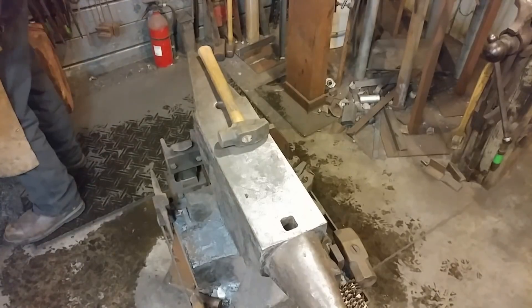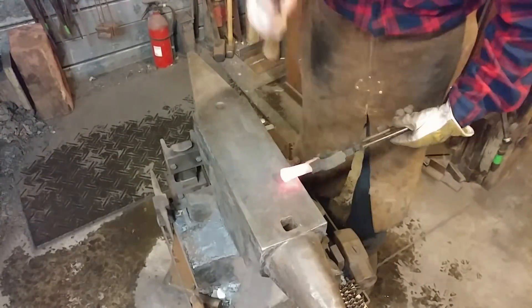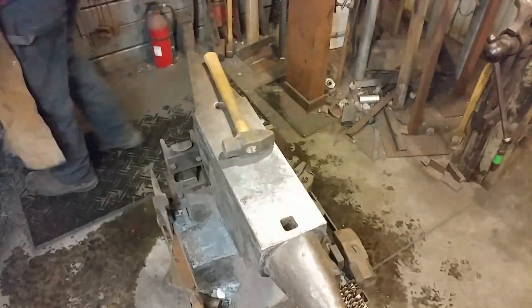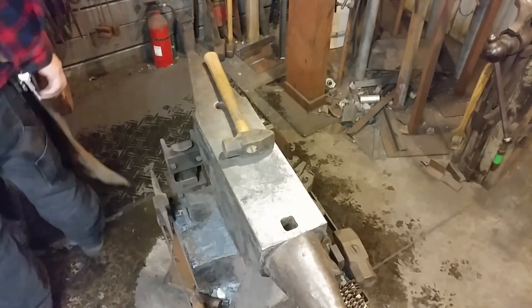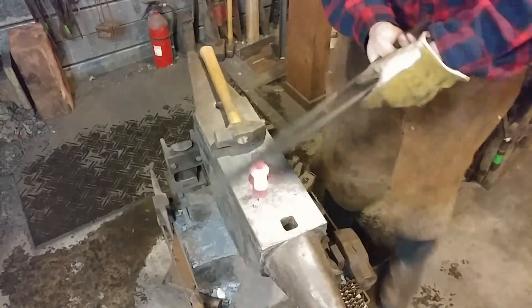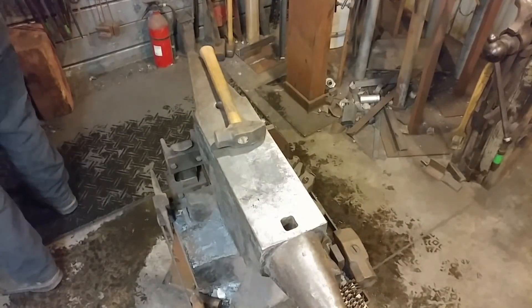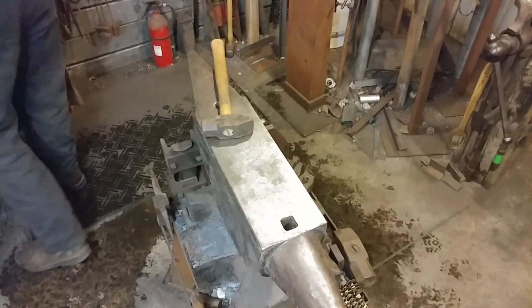What I'm doing now is heating up the piece on one end and upsetting that long end back into a hammer face. This is going to be a round or coin-faced hammer, so I'm going to smooth off the edges so it won't leave any galling, and then polish it perfectly clean to a mirror finish.